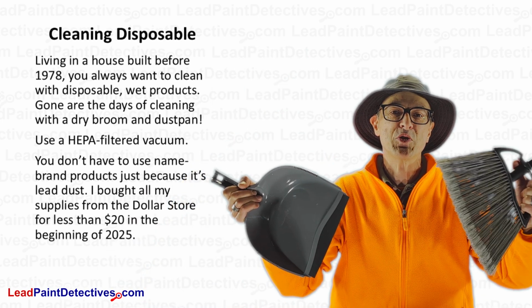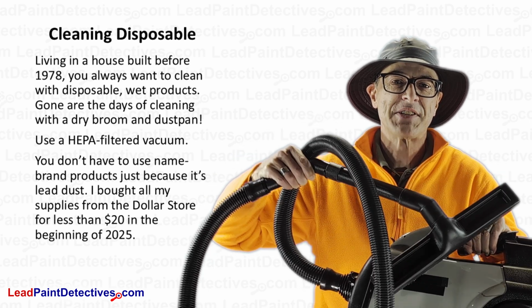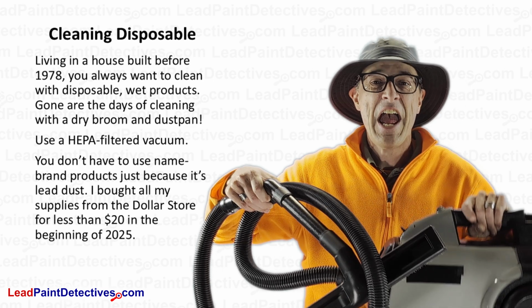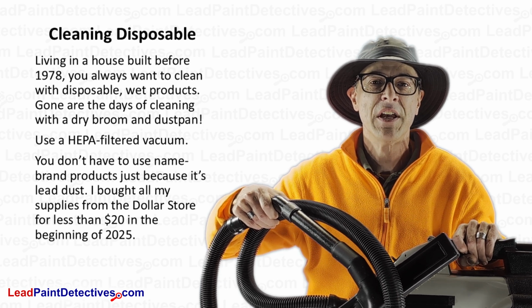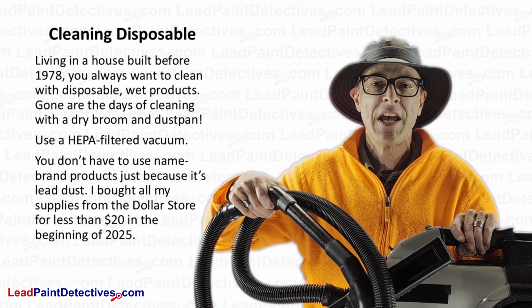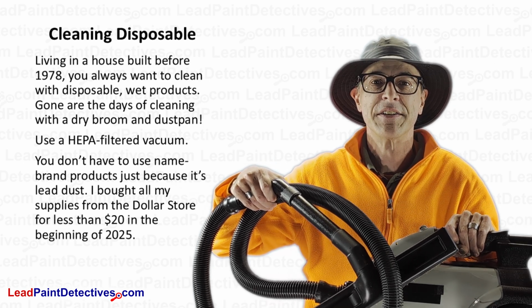Gone are the days where you dry sweep and use a dustpan. Use a HEPA filter vacuum. HEPA stands for High Efficiency Particulate Air. It's a filter on the vacuum that traps harmful particles as small as 0.3 microns. It's very important to use a HEPA vacuum to clean up lead dust, as the HEPA filter traps that lead dust. Standard vacuums just don't do that.